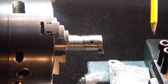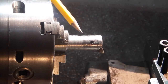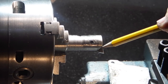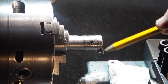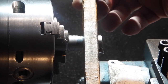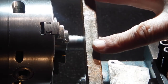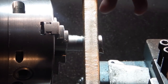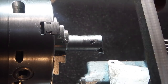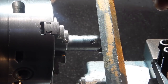I've fitted a fly cutter in the lathe chuck. It's a bar of steel that's been turned down, a hole drilled at about 45 degrees, then drilled and tapped to hold a piece of high-speed steel sharpened up ready for cutting. I'm milling this rough piece of steel — the end of a bar, you can see it's bent. I only want six inches of it; I'm trying to true it up, turn it around to get all four sides machined, chop it off to length, and then make the dial indicator holder.